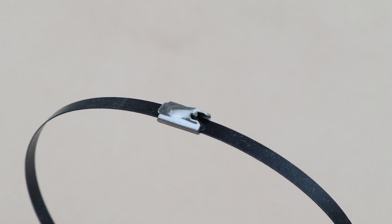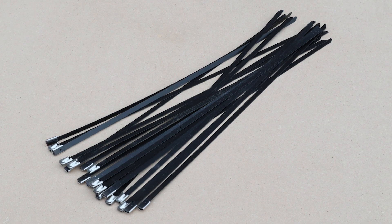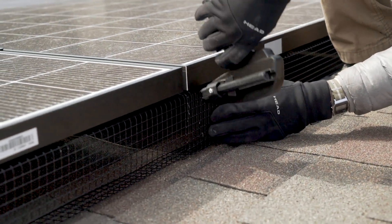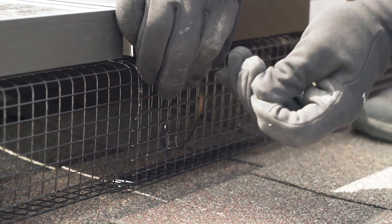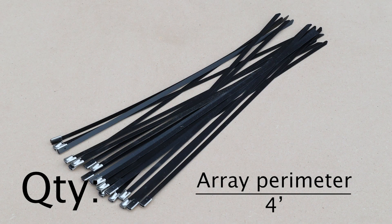You'll need zip ties, and we recommend stainless ones, because no plastic zip tie — even one claiming to be UV resistant — will last 25 years in the sun. 11 inch zip ties will cover every situation. Order the same number of zip ties as you did screws. If you're a professional installer, you might want to invest in a semi-automatic hog ring gun, which is the fastest way to join sections of wire mesh. Another option that's cheaper for one-off jobs is to just use more zip ties — we'll demonstrate both. You'll use about one hog ring for every 2 feet of array perimeter, or one extra zip tie per 4 feet. Many of these materials can be found pre-painted black, and pros should definitely seek those out.